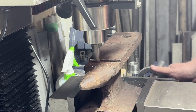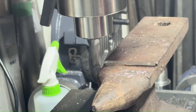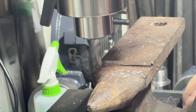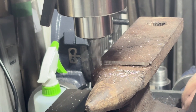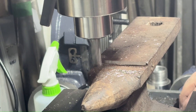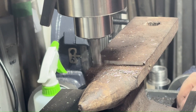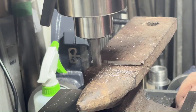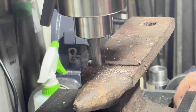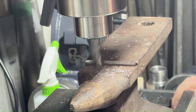I'm just trying to get a nice flat edge on that lip going up to the main deck. After that it's just a matter of cleaning off the bottom of the material going into the horn. When I did this it took off quite a bit of material and left quite the edge going into the horn. I talked to the owner and said, 'What do you want to do here — we can sand it all down and machine it down, or I can come up from that point on about a 25 to 30 degree angle and just taper it off into the horn.'